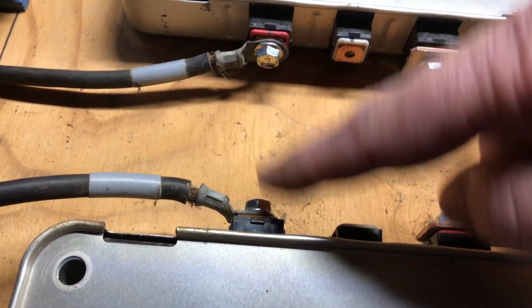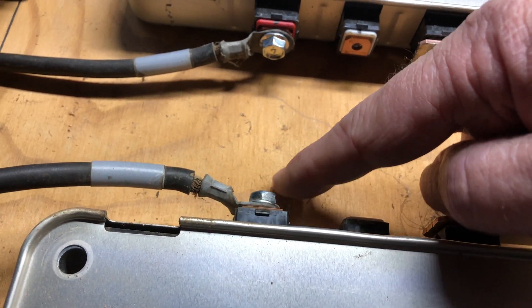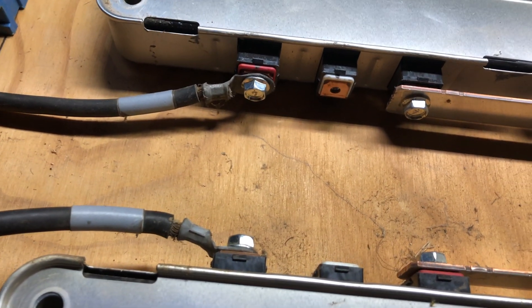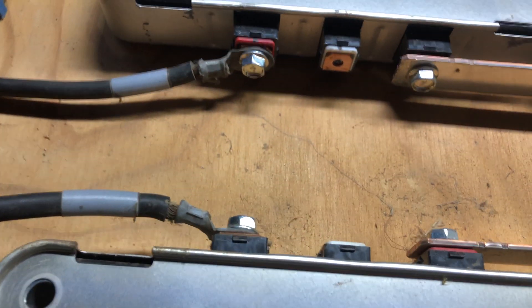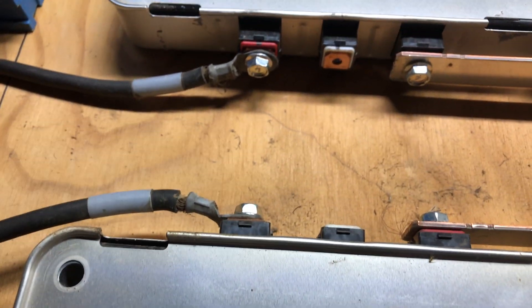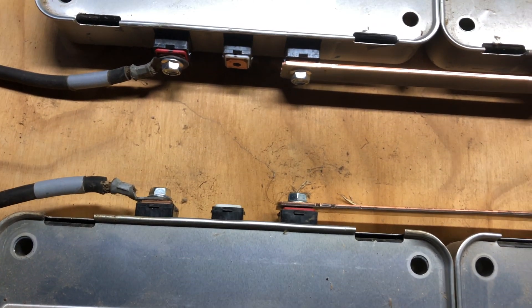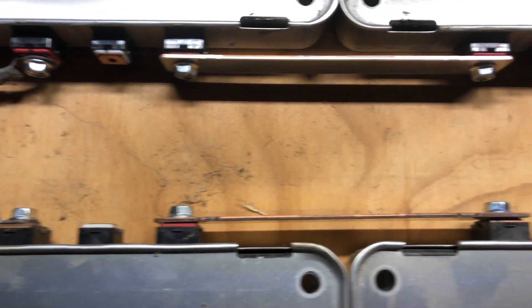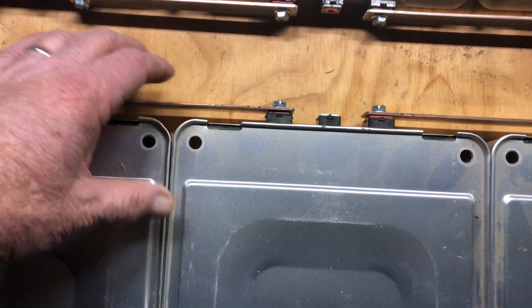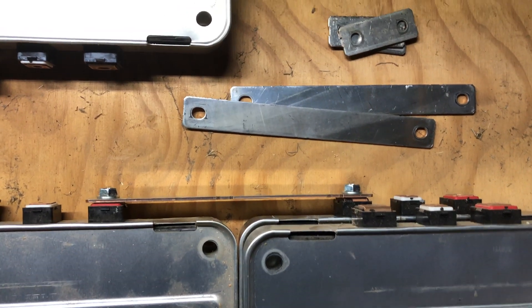Where we're connecting across in series, I would make a U-shaped copper terminal connector and put it in between. I wouldn't use flexible cables if I can help it anywhere in this, except to run down to the inverter. You can see how nicely these just lay flat — everything's nice and compact on the Leaf modules.